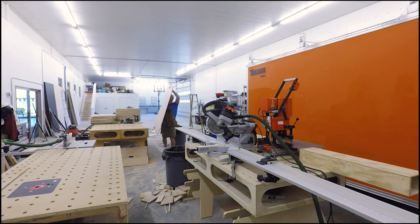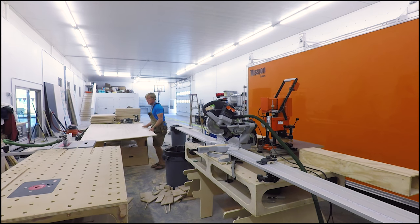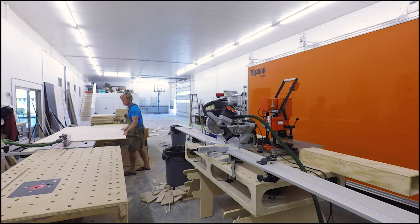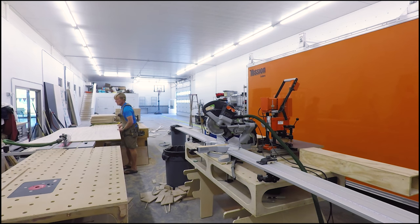I have 40 fronts and backs and 40 sides, so 80 pieces to cut. I used up all of my fall-off and had to go to some full sheets of 12mm plywood. I decided instead of using the track, since the table saw was set up with in-feed and out-feed, I just pushed a full sheet through. I wouldn't do this if it were my final cut — if the cut were critical, I'd want to use the track.